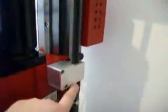Next process is, now we actually have this locked off, we're going to remove the handle again. I put the screw in, but there was no need to put the screw in because this key's in with the nut underneath anyway. We're going to need to remove this handle again because this threaded rod is going to need to drop past that handle, and we're going to be able to very carefully bring this down and locate it with the keyway holes there. That can be simply done by either rotating the thread by hand, or I guess you could just lock a screwdriver into the motor mount there and then just wind that down and slowly precisely get it into position. Okay, we're now going to do that.